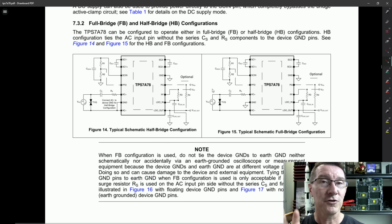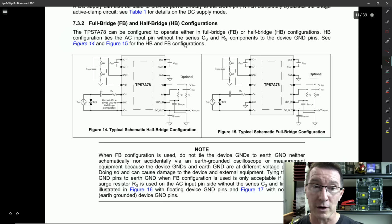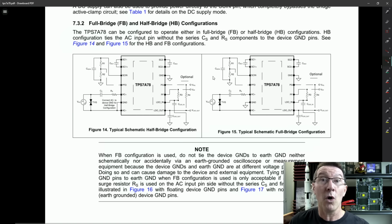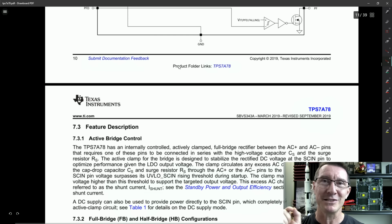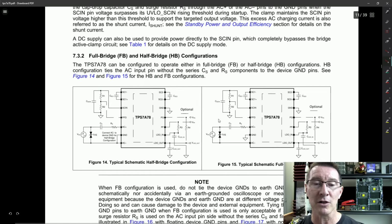I like this one. So if you're after a direct mains connected low quiescent current solution with direct linear voltage regulator output, non-isolated of course, then this is well worth a look. And yeah, it's a bit expensive, you know, a buck a chip, but it's a really nice solution. You want the lowest quiescent current possible, this could do the business. Unfortunately, this chip is only available in versions with fixed output voltages up to 5 volts. It doesn't go to 15. Don't know why. So it's not suitable in this particular circumstance with this particular smoke sensor chip. But anyway, I thought I'd show you that because that is a really nice solution chip.